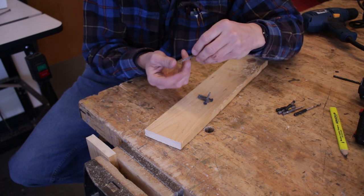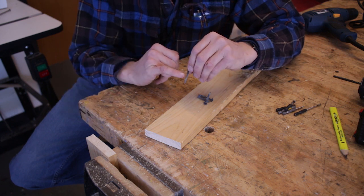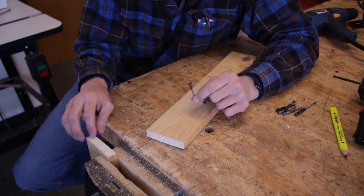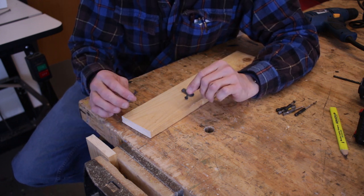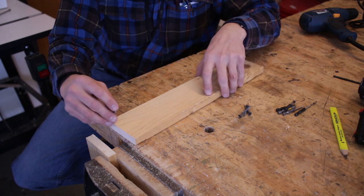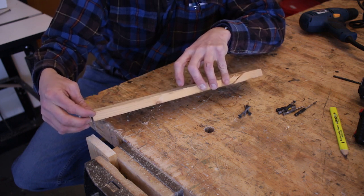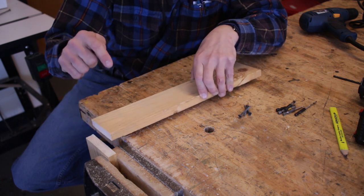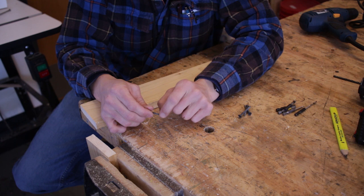The power of a screw comes from its teeth — an inclined plane wrapped around the shaft — which need to bite into the wood. Into the second board we're screwing into, we drill a pilot hole that is the same size as the inner diameter of the screw shaft, leaving the wood where the teeth will actually bite. The other common misconception is that the board the screw goes through first needs the same size hole — that's not true. We want the hole in the top board big enough for the entire screw including the threads to pass through freely. Otherwise the threads bite both boards, can lift the top board, and leave a gap.